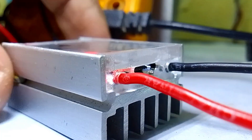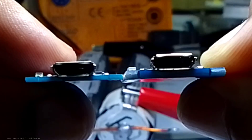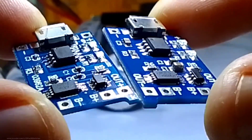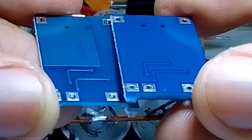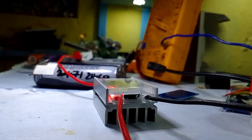If you want to do the same thing, make sure to buy good quality products because there's a big difference when buying online. Here we have two modules that look similar, but the PCB in my right hand is a little thicker, some SMD components are bigger, and the copper layer on the other side is all over the board — that indicates quality. Make sure to check it before you buy. Hope you guys liked the video, thanks for watching, bye.